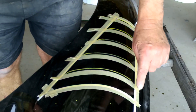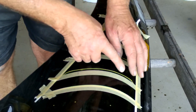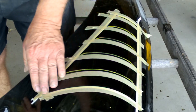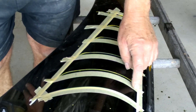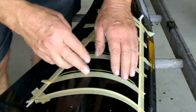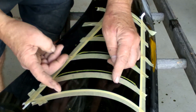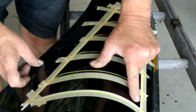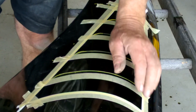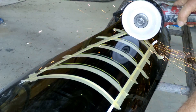If this was a flat panel, you'd probably just cut the outline out and bend that whole piece down to add a new face to the vent. But because this is a curved panel at this point, what I'm going to do instead is cut out the flap that I'll bend down to make the hole where the air's going to come out. Because of that curvature, I'm going to make cuts and put a replacement piece of metal in each of the vents as I'm sculpting this. That way I've just got a flat piece of metal to curve, whereas the original has too many curves to try and straighten up.